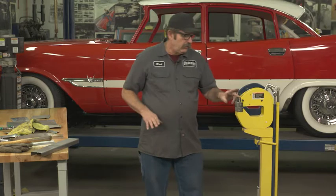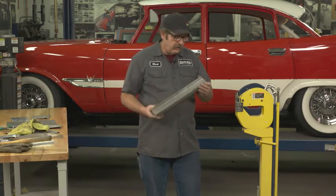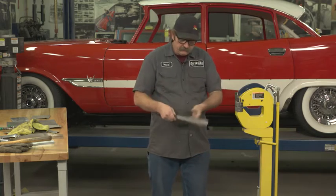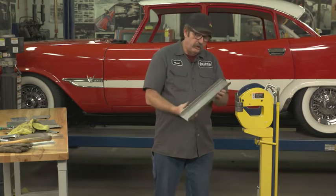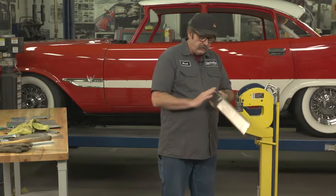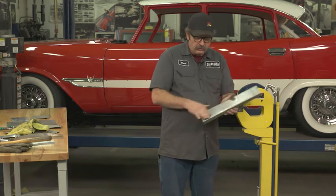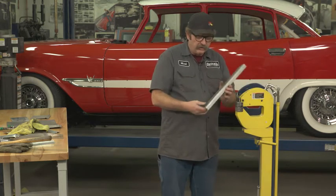So let's take a look at making a stretch first. I have a U channel left over from another project, and we're going to stretch it — this will actually cause what's currently a flat panel to curve.